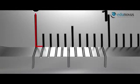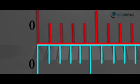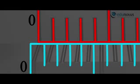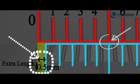In some instruments found in the laboratory, due to excessive wear and tear or manufacturing defects, the zero of the Vernier scale does not coincide with the zero of the main scale — it is either to the right or left of it. If the zero of the Vernier scale is to the right of the zero of the main scale, a particular division of the Vernier scale coincides with a main scale division. This means the calipers is already measuring a certain length as if an object is placed between its jaws even when no object is held.